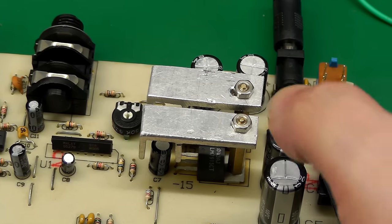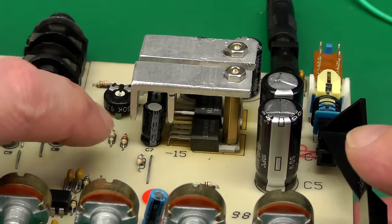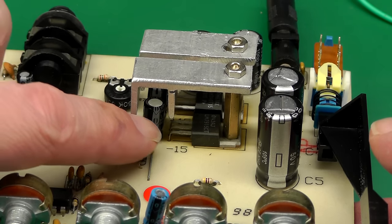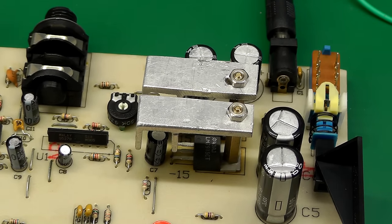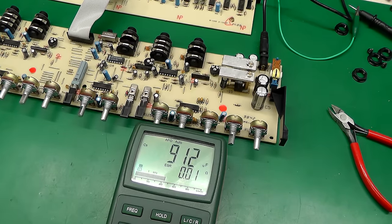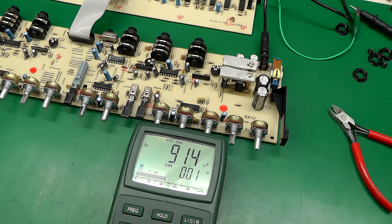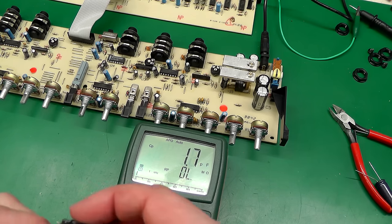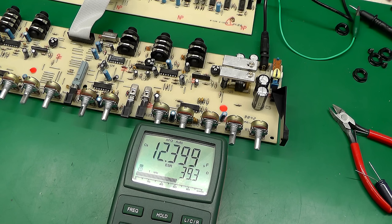There are my two new heat sinks, two replacement pillars fitted, and the caps replaced. I've also replaced the two output capacitors on the regulators. Now, whilst it's heating up, let me test the ESR of the caps I took out. Here's my ESR meter — a reference cap from stock reads 913 microfarads with an ESR of 0.01 ohms. Taking one of the removed capacitors where the electrolyte was pouring out of it: 12.2 microfarads and 39.5 ohms. Wow.